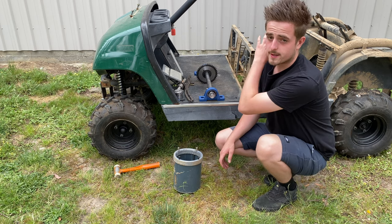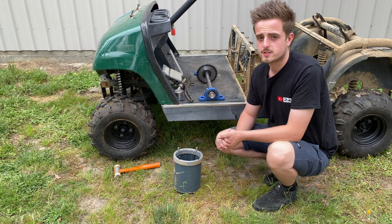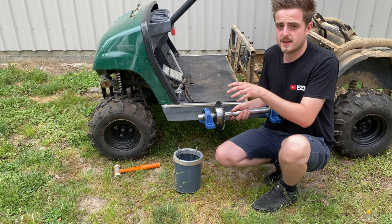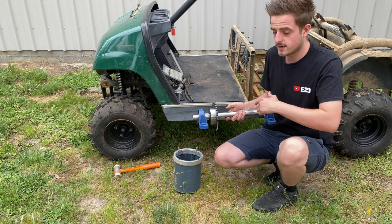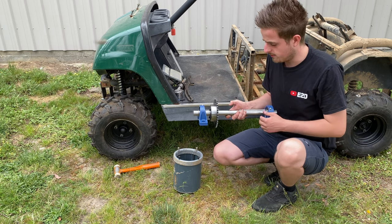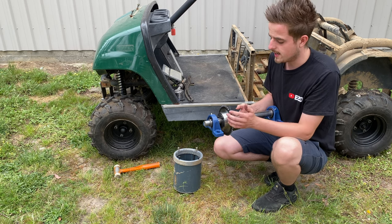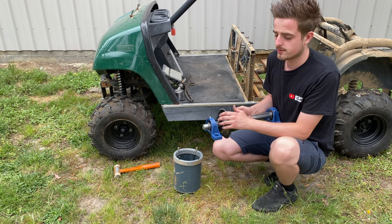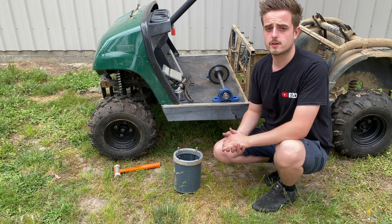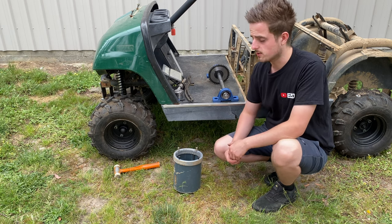I just took the body and the roof off, done that really quick off camera. I want to give you guys an update on this rear end. So what I've done here — this is our jack shaft, which will be in the middle, so the motor will drive the shaft and then the shaft will drive the rear end. This has taken a lot of time to get ready. I've had to get the keyway cut, I've had to get some gears — this is a 38-tooth gear to drive the rear end because we need to get that rear end spinning fast. It is 11 turns of the rear end to one turn of the wheels, so this thing is geared very heavily, so we need to try and speed that up a little bit.